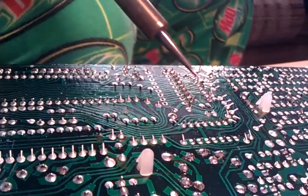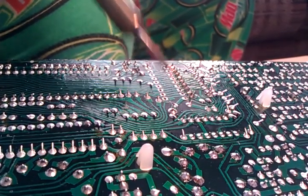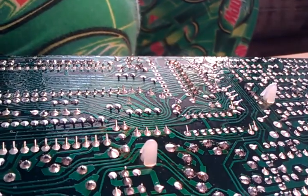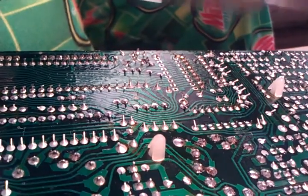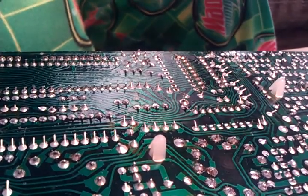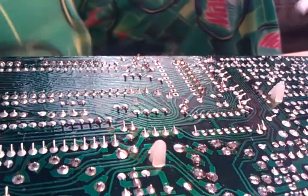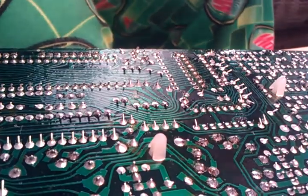What I'm going to do here is just remove this 18-pin IC, as you see right here — I already removed this one — and do it on video so you can see how I'm about to do that. I have my temperature on this iron set pretty high, because I want the solder to be as liquid as possible for the longest amount of time as possible, but not high enough to damage anything, so you work quickly.